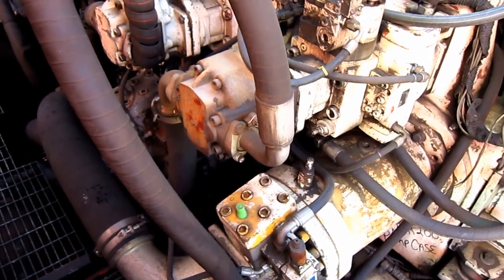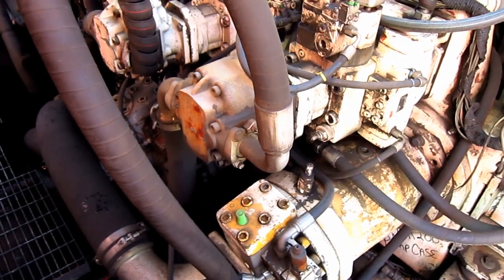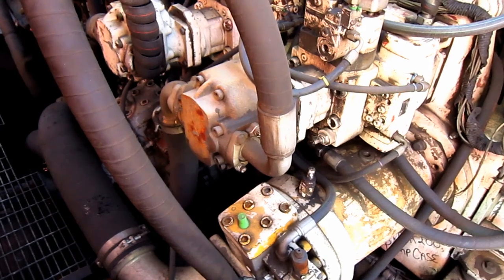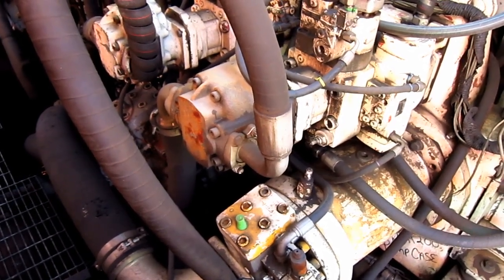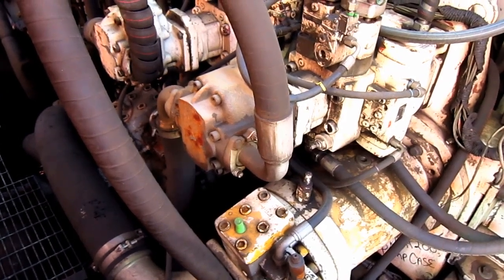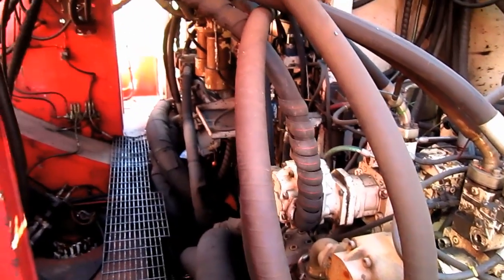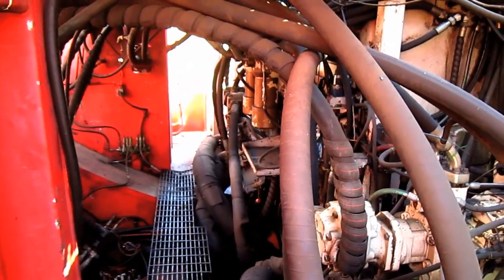The benefit to this is virtually no power loss, lower oil temperatures, and increased fuel savings. In addition, each engine also drives a single servo pump to power the pilot control circuit, along with two gear-type cooling pumps, each developing 132 GPM to deliver high-volume, low-pressure oil to the oil coolers.